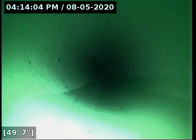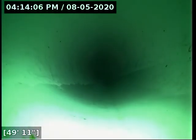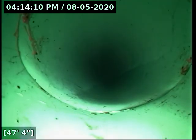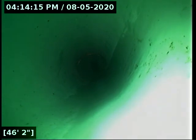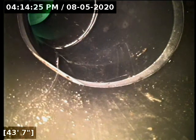And the distance out from the home there, you're all the way out by the street edge where that standing water is. In the world of bellies, that is extremely minor. I don't even start considering repairs on bellies until there's at least an inch of water for 5 to 10 feet, but there also has to be buildup associated with it to show me it's actually causing flow problems. And by the way, this 3034 is 4-inch, not 6-inch like I said before.